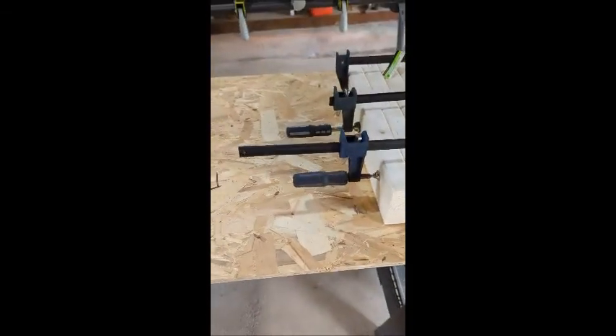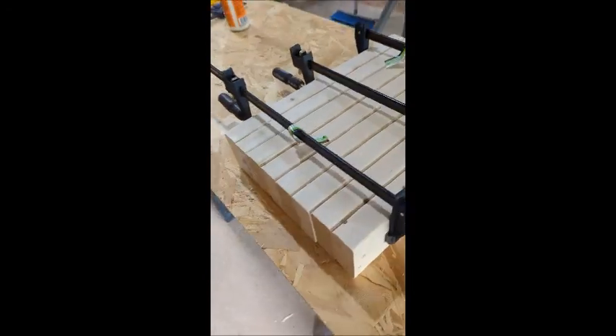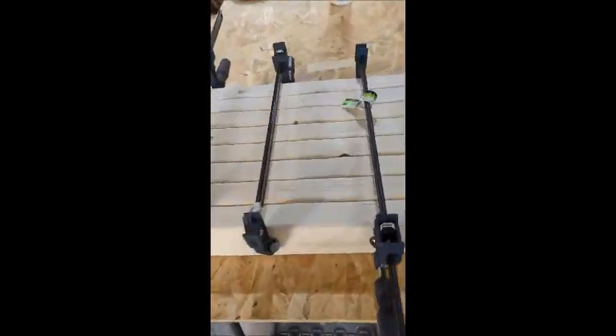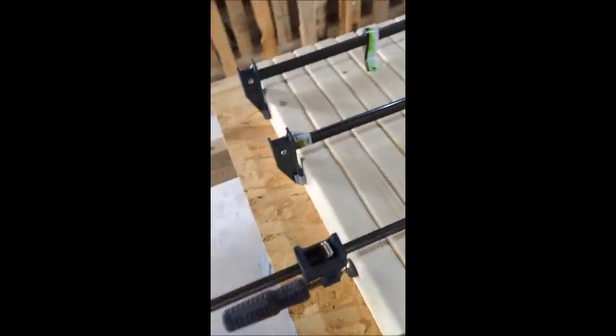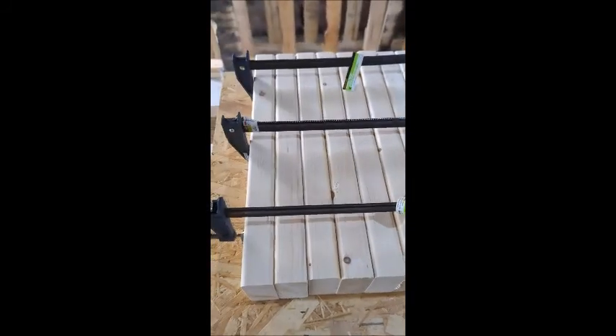Because I didn't really have enough clamps out here, I got them all nailed together and glued, and then I figured I'd just put three clamps on the legs all side by side. That's a glue up, that's a glue up, that's a glue up, and that's a glue up. That'll give it enough time to dry. This Gorilla Glue takes a little longer than Titebond to dry, unfortunately, and it's also 80 degrees and humid, but we'll see.